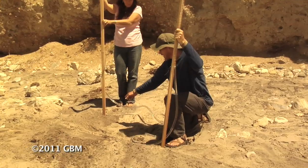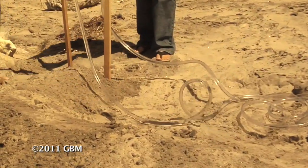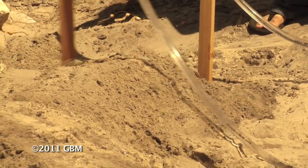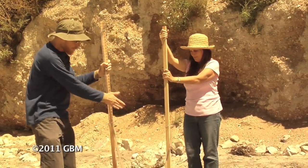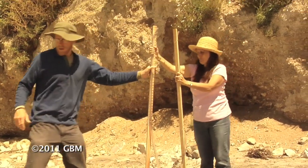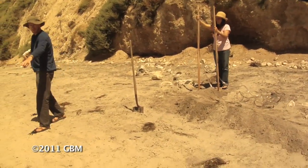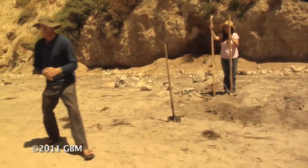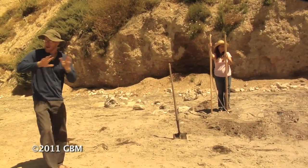The key thing is that overflow level is at least 4 inches lower than here - that is the overflow spillway. That's key because we want the water to overflow where we want it to. If it were to overflow here, we could create another berm, so that overflow water would be caught in the next structure. We're slowing, spreading, and sinking the flow of water. This one could fill up and then overflow to one down there, so we're capturing it from the very top all the way to the bottom.